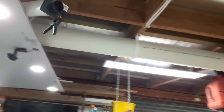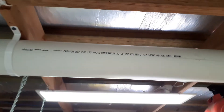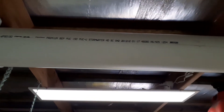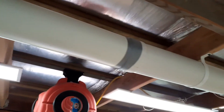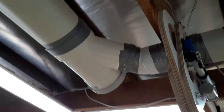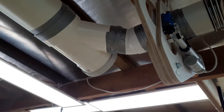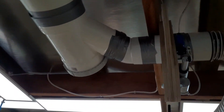Continuing down with the 6-inch, which is 150 millimeters — I've used 150mm stormwater pipe, and it does work with all of the stormwater fittings and also the sewer fittings. There's no problem with it. They told me when I bought the stuff that they won't work with each other — well, they do.